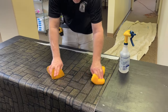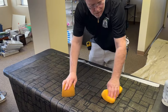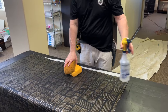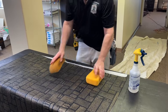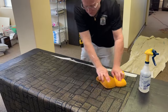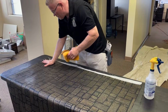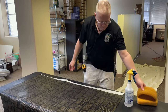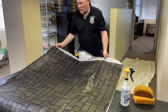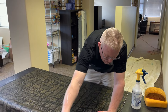So if you want to book your material well, you can kill two birds with one stone by wiping it down. If you got paste on the front of the product, if you're using a pasting machine, or if your table got paste on it, look what I'm doing. I'm doing two things here. One, I'm cleaning it. All I'm gonna have to do is wipe it down when I get it on the wall. Secondly, and more importantly at this point, is I'm mashing the wallpaper backing together.